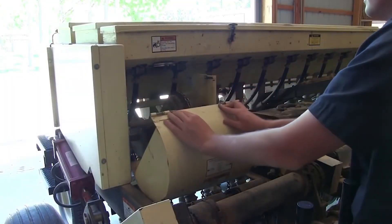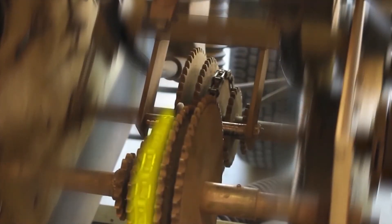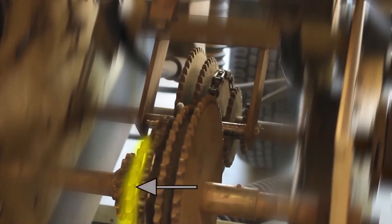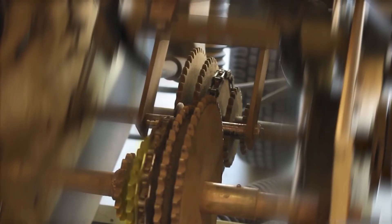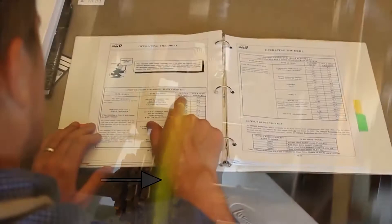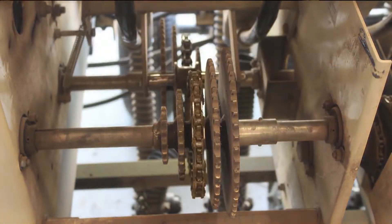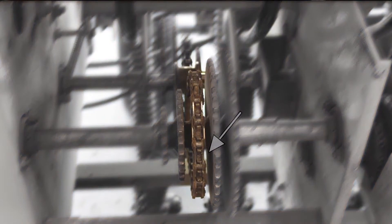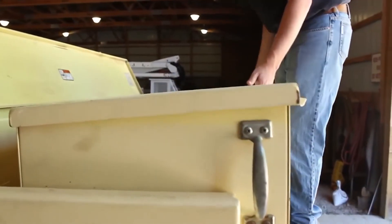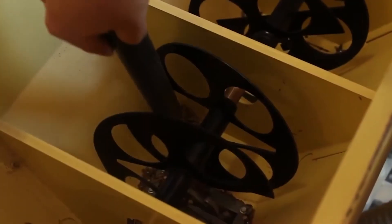First, adjust the gear output of the fluffy seed box to the recommended setting. You can increase the seed rate by moving the chain to the left to a smaller sprocket, or decrease it by moving to the right to a larger sprocket. If there is no chart that corresponds with the seed you are planting, start the calibration process on the middle setting. If your drill is a rental, you should vacuum out the seed boxes prior to calibration and planting to guarantee that you are planting only your seed.